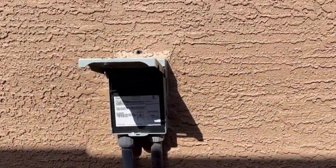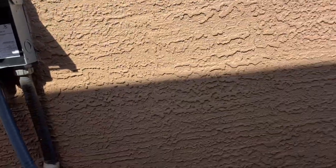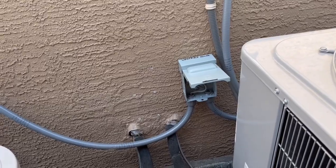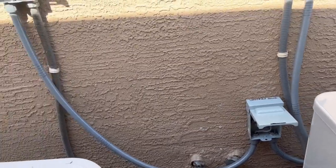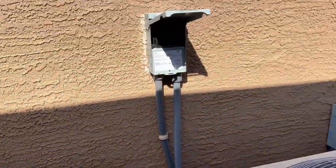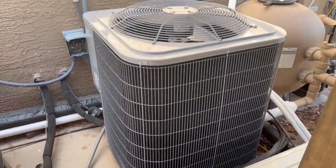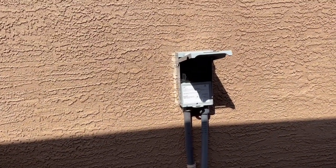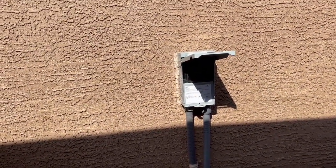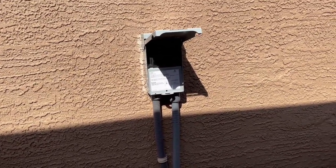On the grid one, you can see we don't have the fuse in there. So we only have one fuse to use between solar and the grid — it's either in the solar or it's in the grid, but it can't be in both. We did the same thing for the upstairs four ton, but we used different AC disconnect boxes so that you can't use the same type of fuse handle.